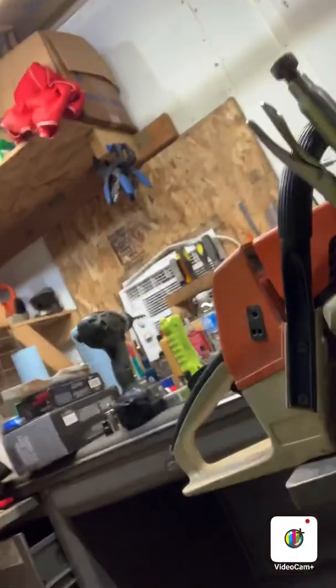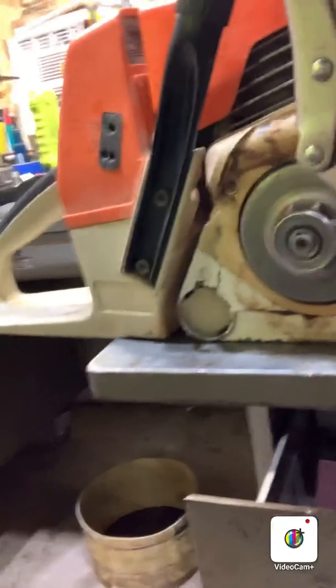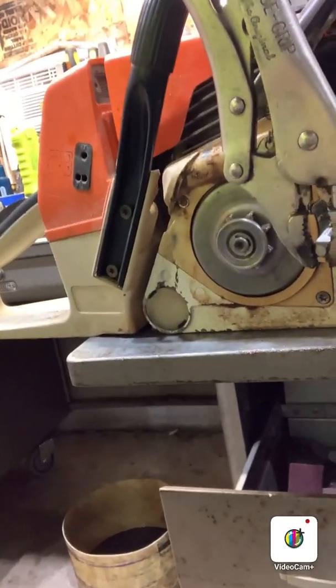So that's what I'm going to do. I will use bearing mount green loctite with primer when I put the helicoil in there, so it should be stuck and never come out. I'll shut the video off for now, finish tapping this hole out, and then I'll bring you back and maybe let you watch me set the helicoil in there.